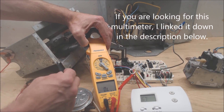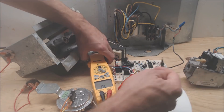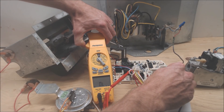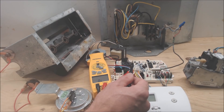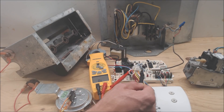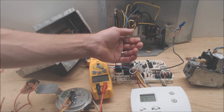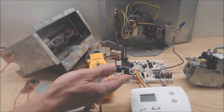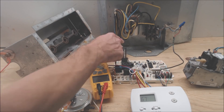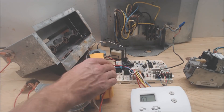Check the other side as well, testing to ground to make sure it is not shorting. Also check whether the hot and common are shorting to each other. On a forced air gas furnace at the gas valve, the common and ground are tied together, so you should get a resistance value regardless of whether you touch ground or common if there is a short there. Basically you just have a 24-volt short between one of the 24-volt power wires and common, happening in front of the control board — not at the transformer, because the fuse is protecting the transformer.